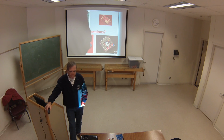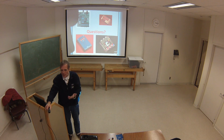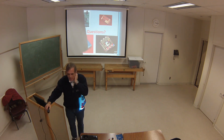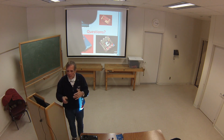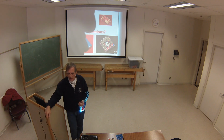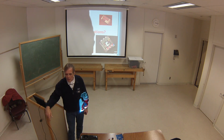Craig, are they still using their keyer on the balloon flights? They still do them every now and then, and they still use the keyer. They used the very first one, and that didn't have the delay command. I don't know if you're familiar with the delay command. Right now you can put a D key in, and that tells it a number of half second delays to wait before repeating the message again. So you can put 1 through 9, and if you put 0, then it turns it off. If you put a 9 in there and then key in any one of the messages, after 4.5 seconds it'll repeat it. And that's what they wanted. They were jamming it on with a wire jumper before, but this makes it real easy now, so anybody can do that. If you're doing a CQ and you want it to repeat, you can just put a number of seconds between them, and put any value you want there.